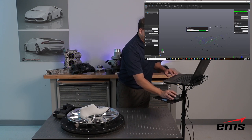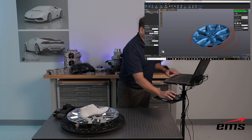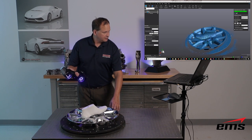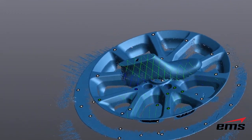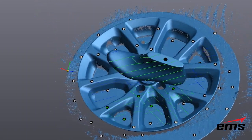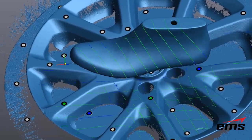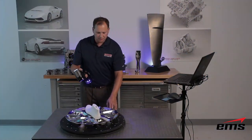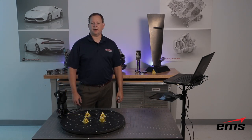That's where HDR mode comes into play. We hit stop scan, then select the High Contrast mode preset. Now when we scan again, the scanner pulses the laser numerous times at different settings — and without any trouble at all it's picking up the shoe on top of the rim simultaneously. Zooming in you can see it's picking up all the little dents on the shoe while still capturing the wheel. That's the HDR mode, and the high contrast preset usually works very well without needing manual adjustment.